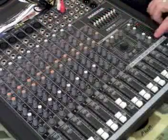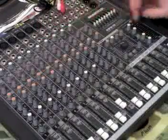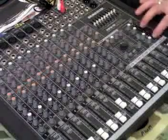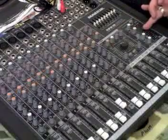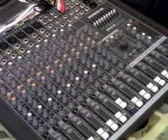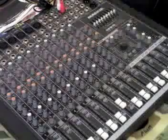lot more detail. So you can see exactly where on the scale the sound is sitting, and you can adjust the gain control until you get it in a range that you're comfortable with here on the ladder meter. So around the sort of 0, 2 or 4, +2 or +4 decibel level here. And then you disengage that and you're back to a full mix again.